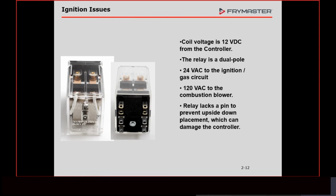If the blower doesn't come on and the fryer continues to pop and those burners go bad, there are times where oil migration is so bad that you can't get the burners out because of all the oil built up around them. At that point, that requires a new fry pot, all because these contacts here weren't sending enough voltage down to the blower motor.